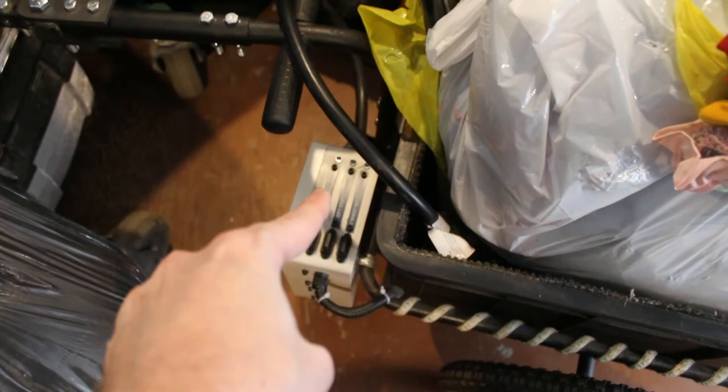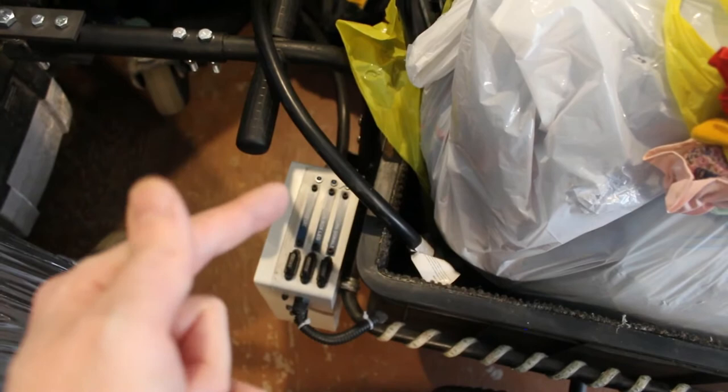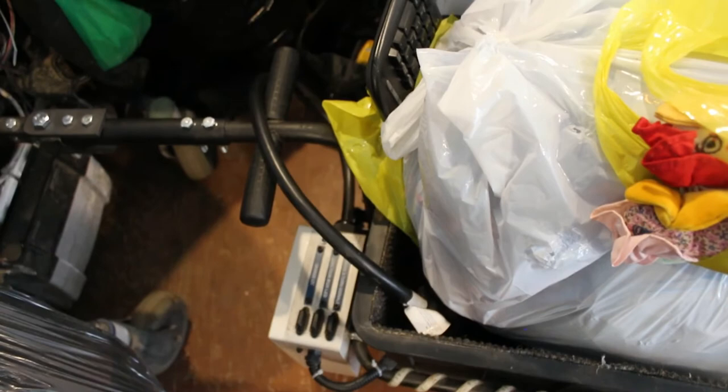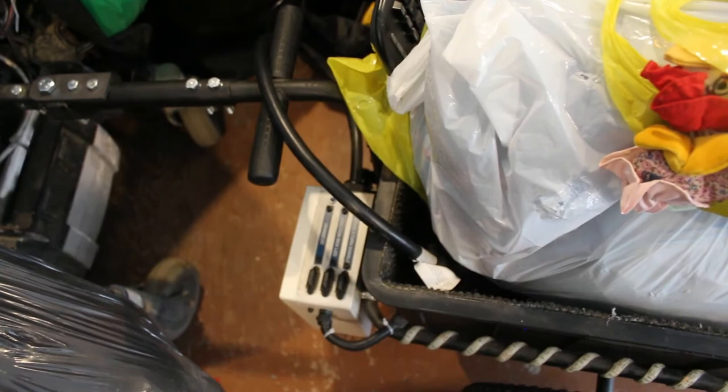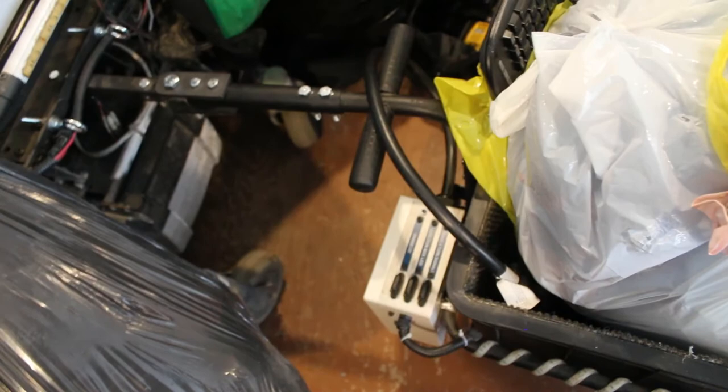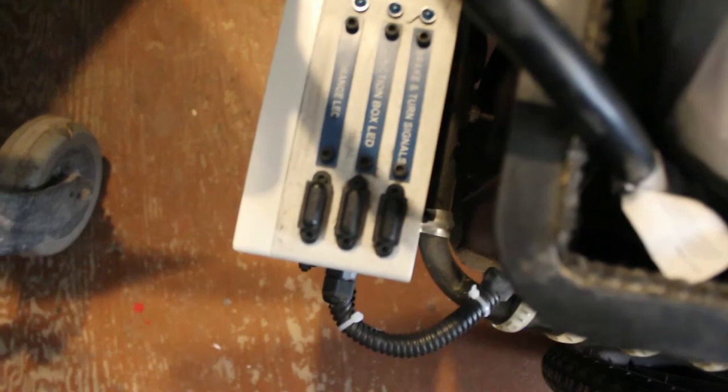You don't need to do what I've done for all the fancy lighting. You could simply have a few switches and a relay - the kind of turn signal relay a 12-volt vehicle or boat uses - to flash left, right, or four-way flashers. You could run that from a little 12-volt 7-amp-hour battery instead of joining it to the wheelchair batteries, because you're going to void your warranty if you connect to the wheelchair batteries. Talk to people in your life who are electricians - even an hour of consultation fees would be well worth it.